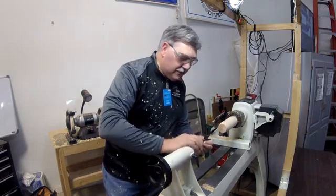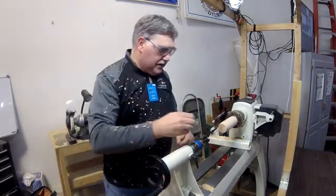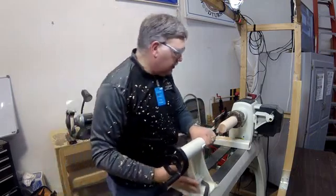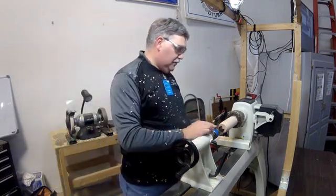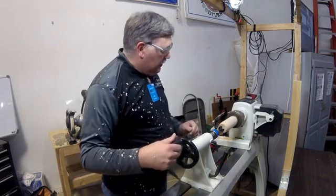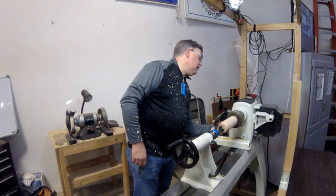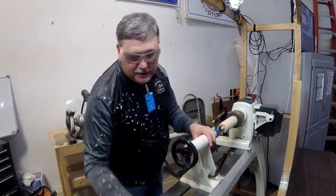Even though I don't have one large enough to do what I want to do, I'm going to go ahead and do it. I really want an inch and a half, but I'm going to drill it out 1 3/8 here, just because I can drill much faster with this. Also, if you have an air compressor, instead of pulling your bit out every time you want to clear it, you can just follow behind with your air compressor. I'm creeping again, aren't I?